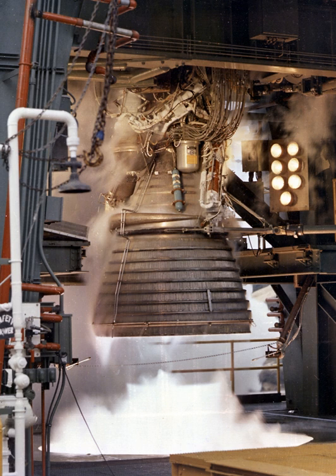The heat exchanger was a shell assembly consisting of a duct, bellows, flanges, and coils. It was mounted in the turbine exhaust duct between the oxidizer turbine discharge manifold and the thrust chamber. It heated and expanded helium gas for use in the third stage, or converted LOX to gaseous oxygen for the second stage for maintaining vehicle oxidizer tank pressurization. During engine operation, either LOX was tapped off the oxidizer high-pressure duct or helium was provided from the vehicle stage and routed to the heat exchanger coils.